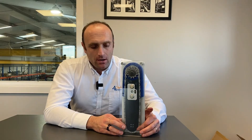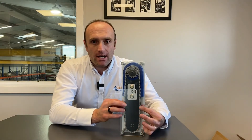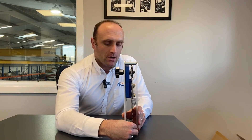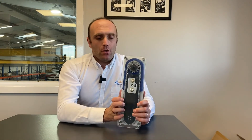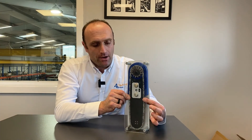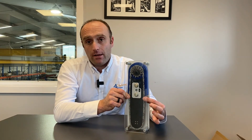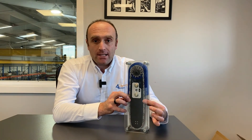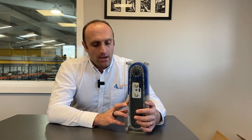The big points here with chain tension — it's so important. If your chain is too tight then you could deform this black blade, so it won't be square, and in order for a straight cut you need a little bit of play and not too tight. Likewise, if your chain is too slack and it's not tight enough, the blade and chain will move around, you'll wear your chain out more and faster, and all in all it's just not a good cutting experience — essentially the chain is doing more work than it needs to.